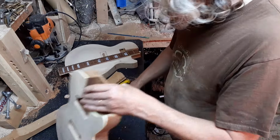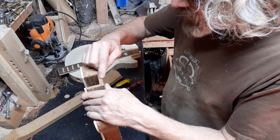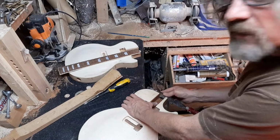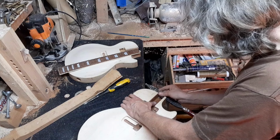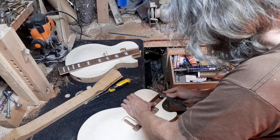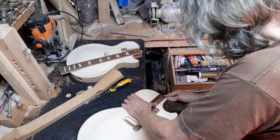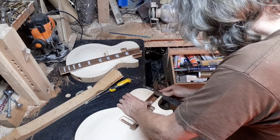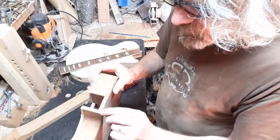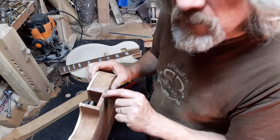It's really nice. But what I also do is wherever my pencil went, I put pencil lead all round so you can see when you've made it flat. It rubs the pencil lead off, but I do use the coarse side of the file because it seems to cut better on the end grain, and just keep going over it. And you can see now, on this edge it hasn't quite got flat yet, but you can see it's all scraped around the edge here.